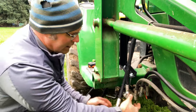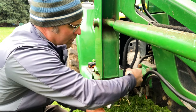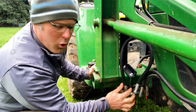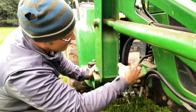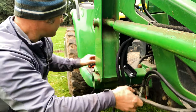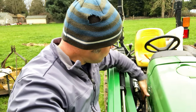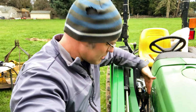Now we're going to repeat the process for the green. It comes out here, and since we've already done the black, I know this one's going to be green — I can go ahead and plug it right in. Make sure those collars seat all the way back forward, especially if it's old and got a little crud in there. That one didn't quite want to seat, so just spin it around a little bit, make sure it seats all the way back. Those hoses aren't going to rub anything. Now I'm ready to take this green and plug it in up on the switching valve. The switching valve is hooked into the loader circuit — we've got hoses disconnected from the loader circuit coming into the switching valve, and hoses going back out of the switching valve connected to the loader circuit.